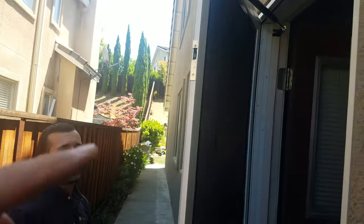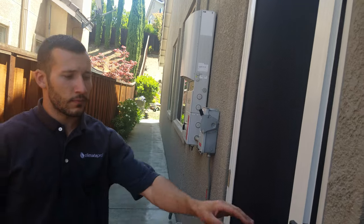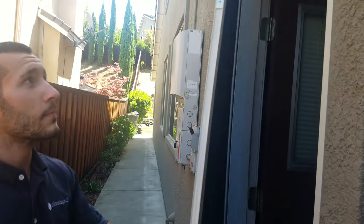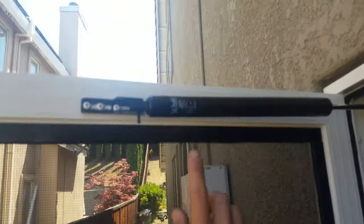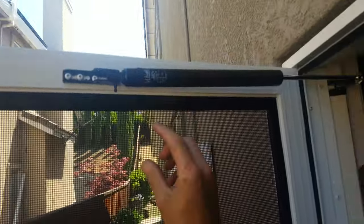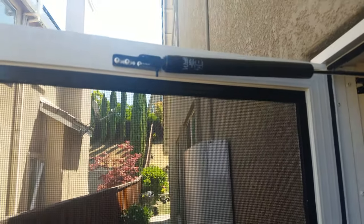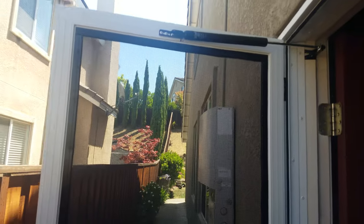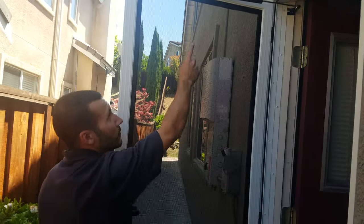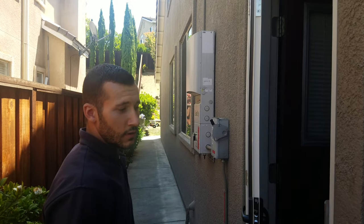What were the markings and instructions on this cylinder, and what do they do? The cylinder has markings that say 'slower' and 'faster.' If you pull this pin out and rotate it in the direction of the arrow, you can pull it back and test it to see how slow it's going to close before you put it back in and it's solid again. So it's closing speed control — you adjust it by turning that.